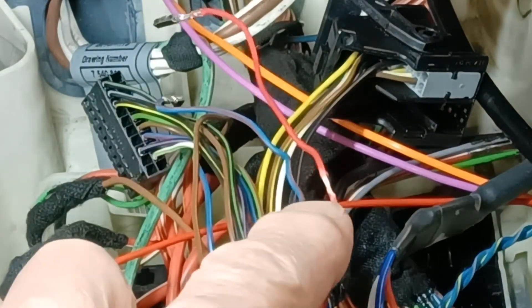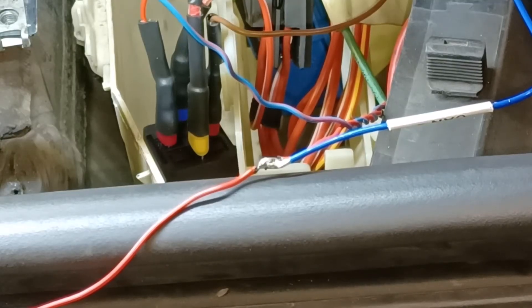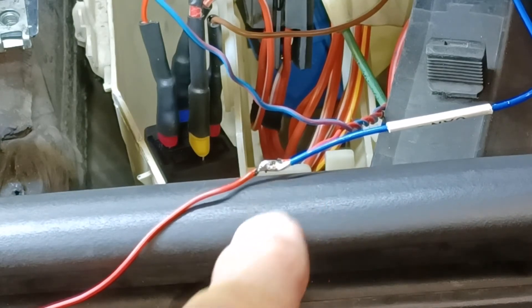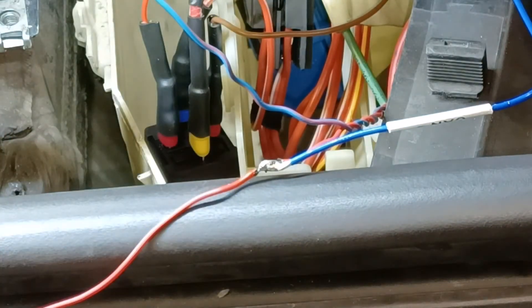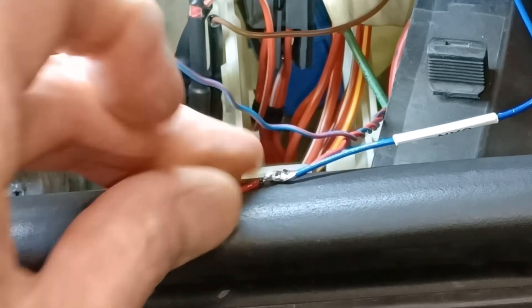I've very carefully skinned the wire, applied some flux around it, and also put flux on the other wire I'm going to connect. In the end I tinned the main red wire, wrapped the other wire around it, applied a very small amount of flux, and soldered it. It's solid. Years ago I did a craft apprenticeship and had to solder over and over until my tutor was satisfied — he'd probably throw a fit seeing this — but it's good enough. Now I'm putting heat shrink tubing over it to hold it in place and seal it up.